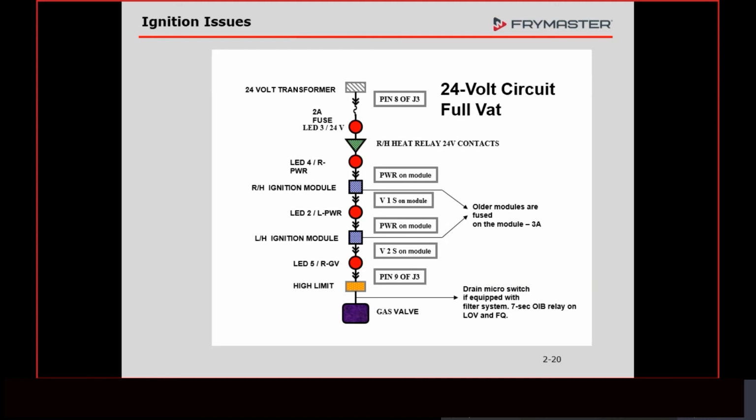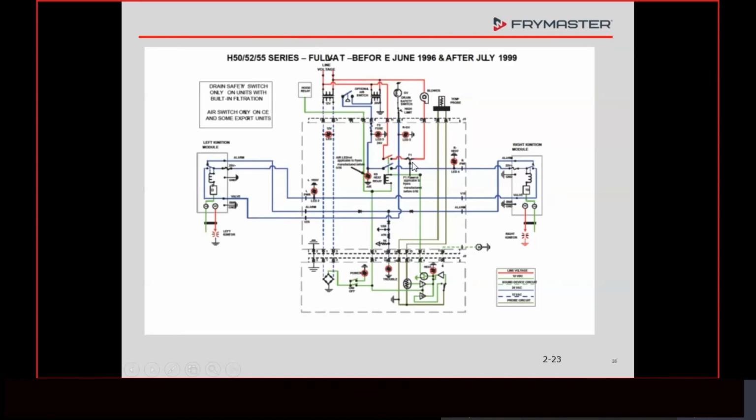So like I said, whenever we're troubleshooting these, just accessing the easiest stuff first is going to lead us on a path. If we went in and we looked in the sight glass and there was no flame, and we looked down, it's like, oh, they forgot to close the drain valve. All right. Or, you may look in the pot and find that the high limit's broke. Not so much anymore, but back in the days when they had hard shortening, they would drop those blocks on there and bam, this was the first thing it would hit. And then those high limits would break over. And then obviously if the high limits broke and you can't get voltage through there, that cuts off the gas valve. Again, the right answer is, what do I check first? The easiest thing to get to, okay? Because we want to minimize how much time we have in the store as much as possible.